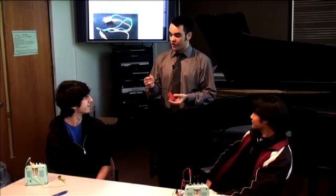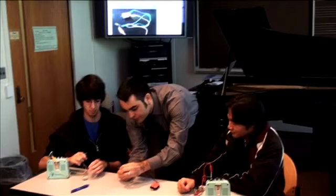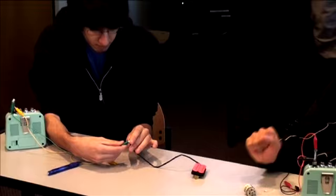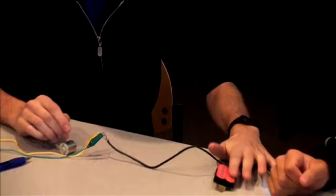This model has four conductors, which allows us to access each of the coils separately. We're going to run them in series and treat them just as one pickup. So this is our ground here, and this is our hot signal, the red. Wait, so does that mean that you're essentially eliminating any benefits of the reverse polarity humbucking action? The humbucking action works in both series and parallel, according to DiMarzio. Wow. It seems like if you ran them in series without reversing them again, you would just knock out the signal altogether. Okay, so you got it in?